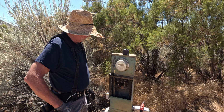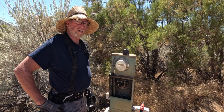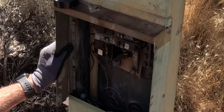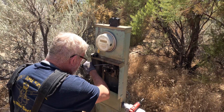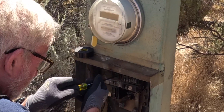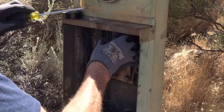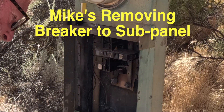So I'm going to try to do this hot today and hopefully I don't slip and mess some stuff up — like myself. I'll shut off the 100 amp main breaker first. I'm going to take out the 100 amp sub-panel breaker and get it out of the way. Okay, the 100 is up and out of the way.